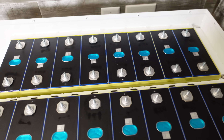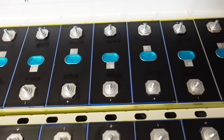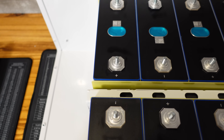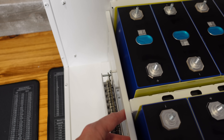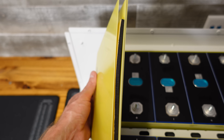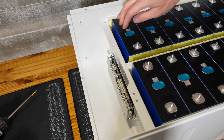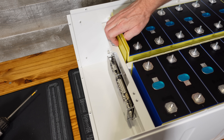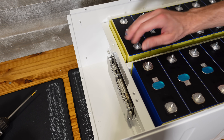With all those cells in, the case is looking great — look how perfectly flat they are. In fact, they are so flat that there's actually some space left at the end, and the foam they sent doesn't even fill it completely. I made little sandwiches out of the remaining epoxy board and a piece of larger foam to slide in there. With the end plate fully tightened down, it really does need a few additional pieces of epoxy board or some other spacer.